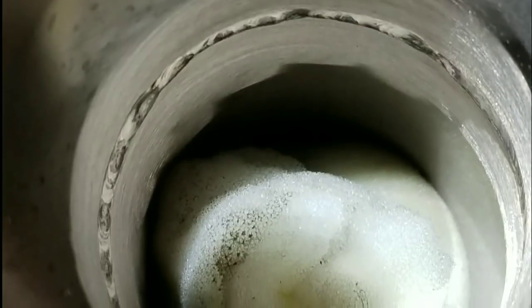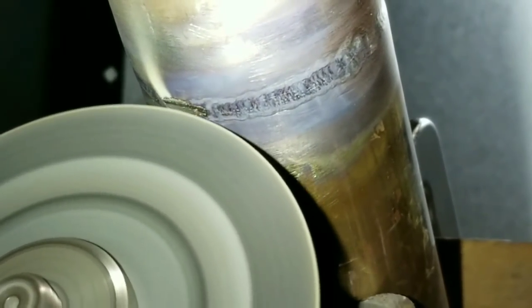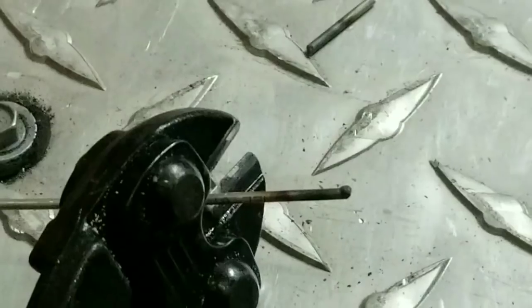Here's a look at our root on the inside — it turned out pretty good. We did have one bad spot, and that's part of this training. We want to show you how to fix a spot that didn't tie in — a fish eye or something like that. We grind about 60% down and back into the root, and that'll give us enough penetration so it'll wet back in just like it was never there. We freehanded it with the tungsten straight in to get as much penetration as possible to break down the little piece of wall that was left. Also, clipped ends on your wires make a big difference when starting back up.